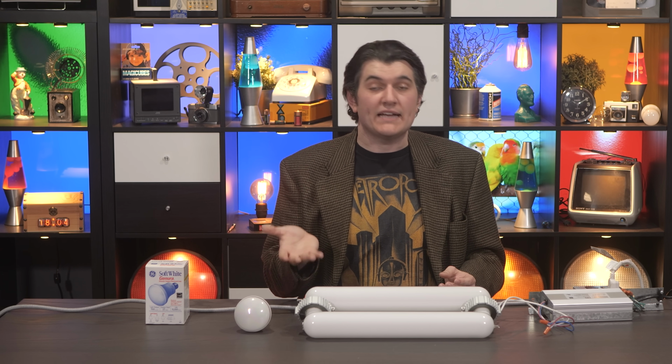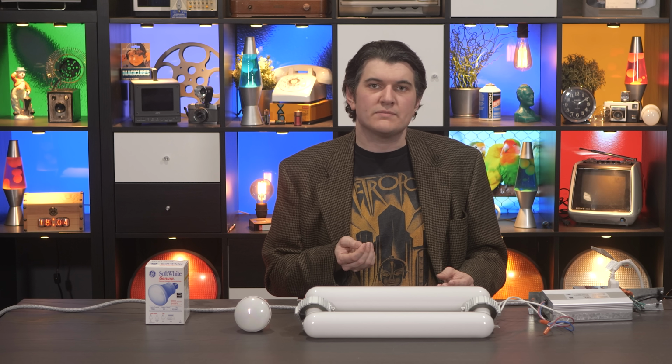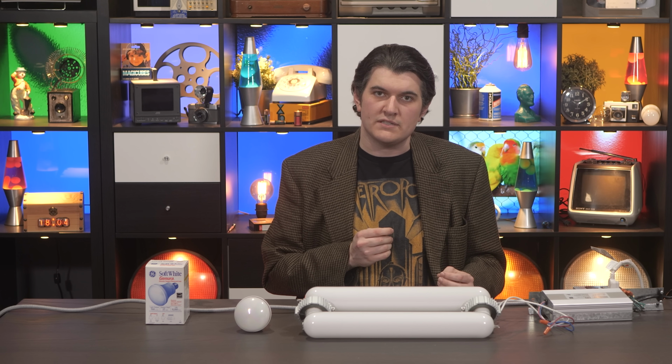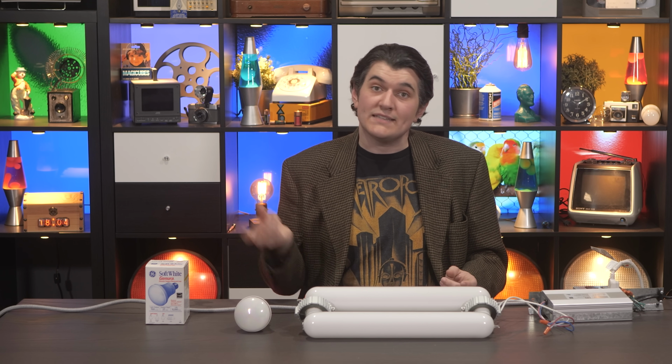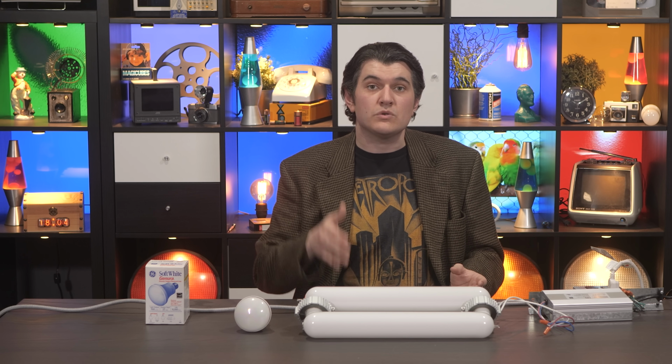Take street lighting as an example. I've encountered a few induction street lamps in the wild, but they all have about as much beam control as a circline fluorescent light stuck in the middle of the kitchen ceiling. Because that's pretty much what they are. And the inverse square law means you can't place the lamps too high above the street, or they just won't offer effective light output. This ultimately means you need many more of them placed closer together.